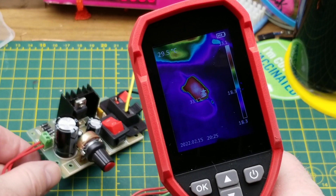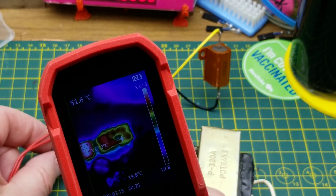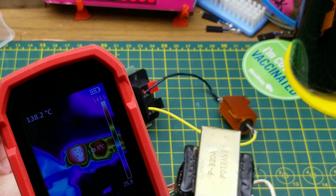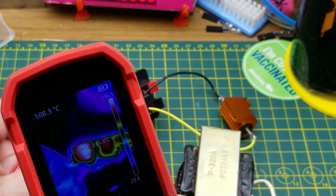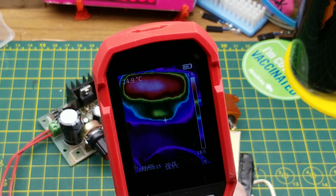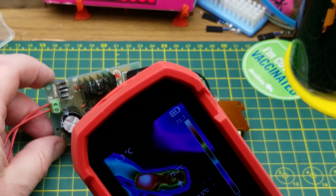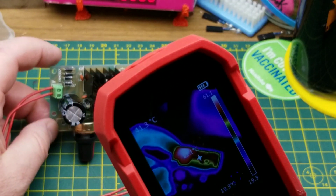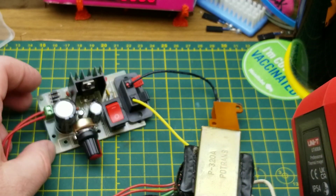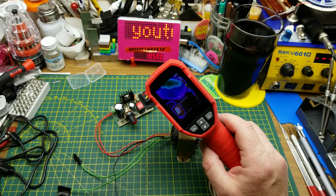It should recalibrate as the temperature gets extreme. The load getting hot is expected, but more importantly — we expect the heat sink on the regulator to get hot, but look at what's going on over here: that full bridge rectifier, those diodes are getting stinking hot — 130 to 140 degrees. That's where this could come in really handy on a hobbyist's bench: a quick shot of a circuit board to find a hot spot when something's not working, like drawing excessive current through those little diodes.